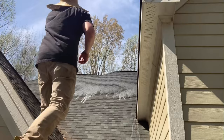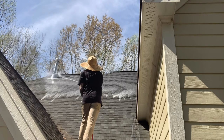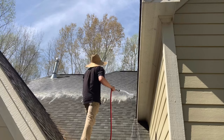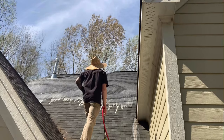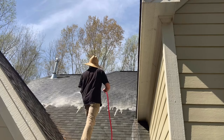You can see how slowly it's moving down the roof — that's because I'm using a surfactant mixed with my sodium hypochlorite. The surfactant's job is to cling to the roof so I can get an adequate dwell time. Dwell time is key because you want that chemical compound to sit on the roof long enough to kill the organic growth. If it's too watered down it's just going to run off and it won't sit up there long enough to kill those black streaks — gloeocapsa magma. So I spray, I wait, then I spray some more, letting it run down as far as it will go to evenly coat the shingles.